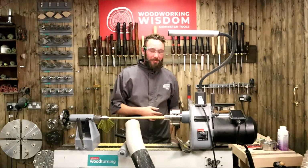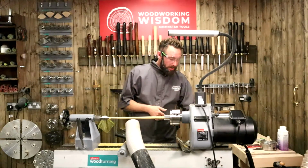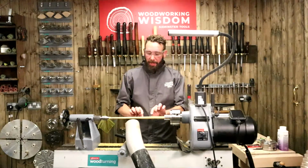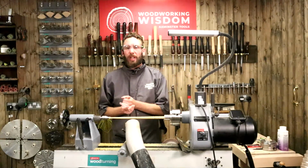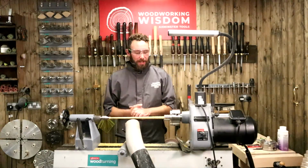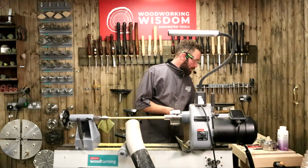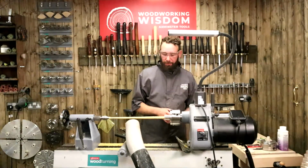Steve here is asking, the turning speeds and the sanding speeds, are they different? I didn't turn it down. I usually would turn that down. Yeah, so the turning speed was 2,500. But yeah, you want to drop that down to around about 1,000 for your sanding. I just quickly whizzed through it then because I'm eager to get onto the next stage. But yeah, bring it down slightly for your sanding.